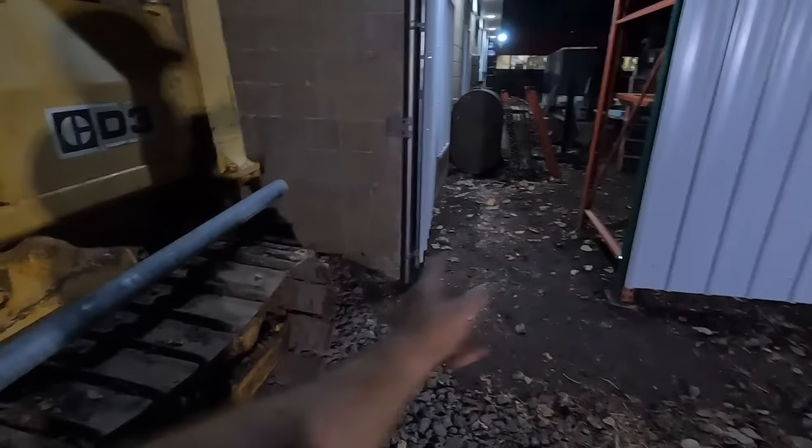Okay, so to be able to use these bulldog hinges, you need a collar at the bottom on the gate, and I don't have that. So that would ride here, and all of your weight on the bottom is literally being pushed on right here in this spot, but there's nothing for this to clamp onto. So plan is gonna be to take a piece of pipe that'll fit in the hole, like so. We'll run it up, I don't know, 6 inches, and we'll cut it to the length there. And then we'll take a piece of pipe that's bigger than it, but it's the same size as this, and we'll cut it only that long right there.